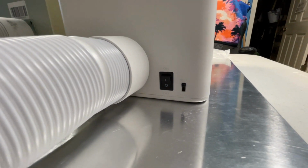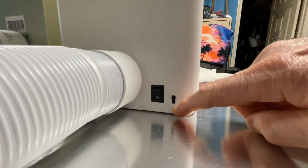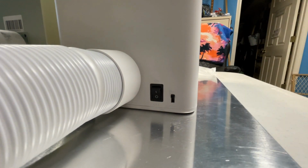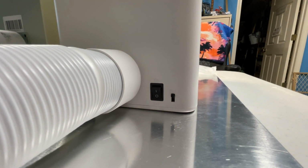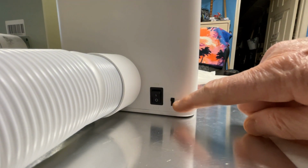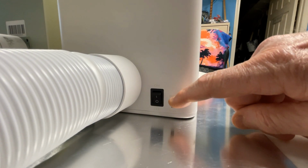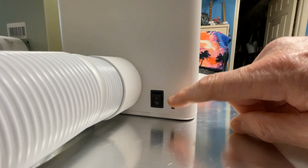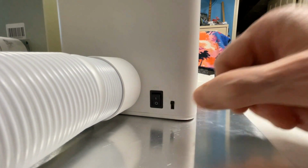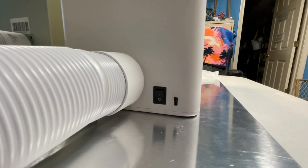Okay, this switch here is actually a 3-position switch: max, medium, and min. It's basically a fan speed. They said if you're using a blue laser, they recommend running it in maximum mode. If it's an infrared laser that you're using, then you can use the next switch down, either the mid speed or the min speed, either one. So it depends on which laser module you're using on the F1.